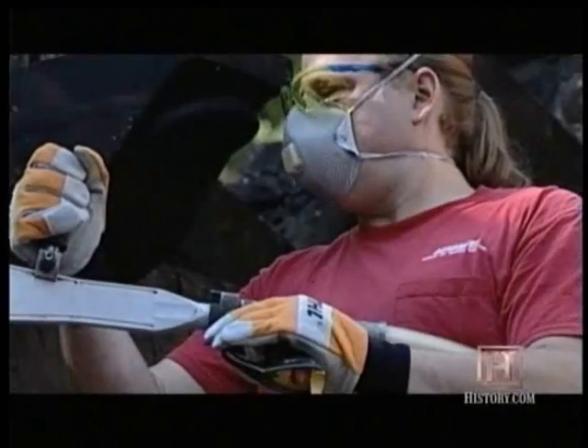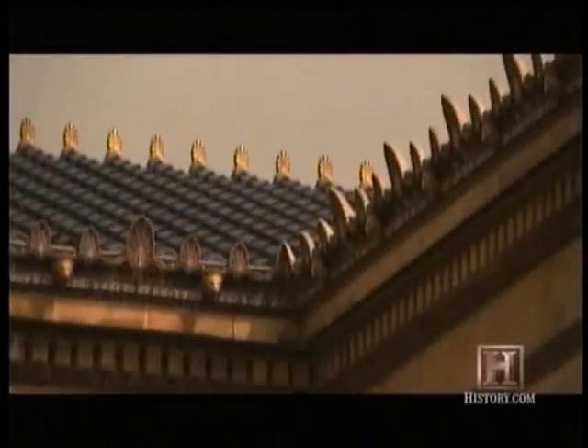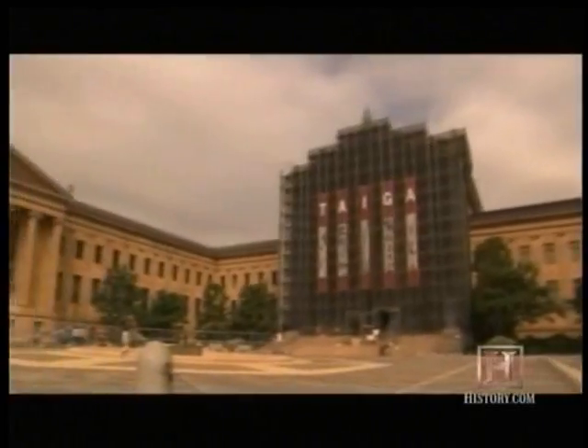So there's the mass of the dry ice striking the surface, the extreme cold, and this explosion that is helping to remove the contaminants. The process has been used to renovate nearly 100-year-old roof tiles at the Philadelphia Museum of Art.